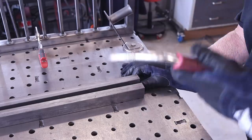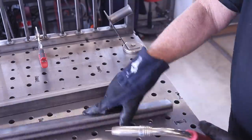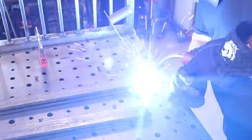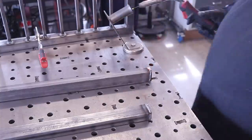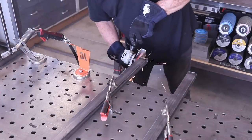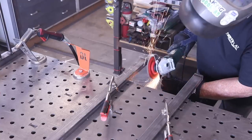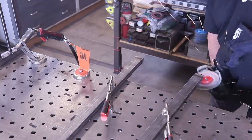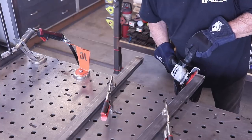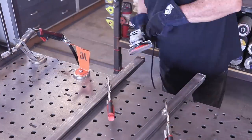One thing left is to get the posts. These posts are a different size — one inch by one and a half inch rectangular tube — which I wanted to use to mount this gate since I was limited on space for this install. I cut off some flat caps for the ends and welded those on the top side. Once those were welded on I made sure to get everything ground down nice and smooth for a clean, solid finish.